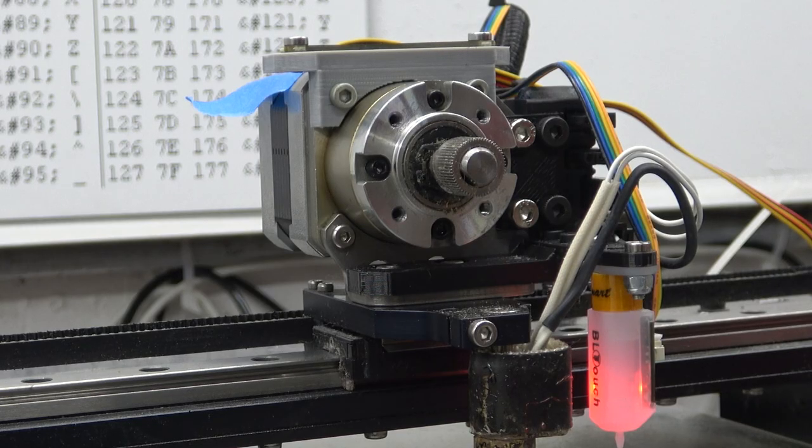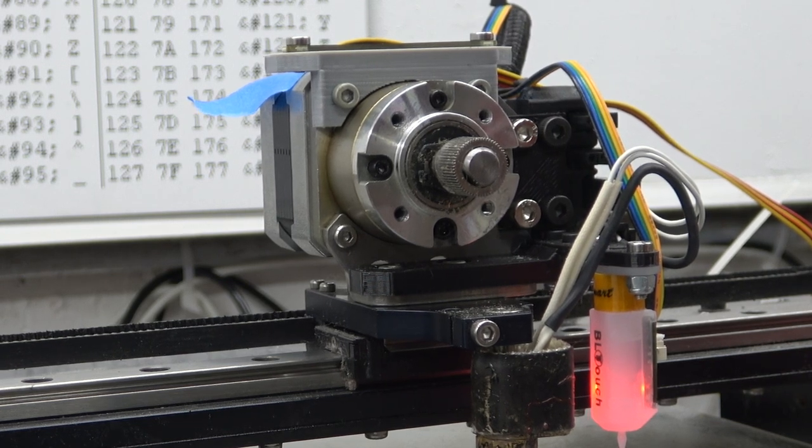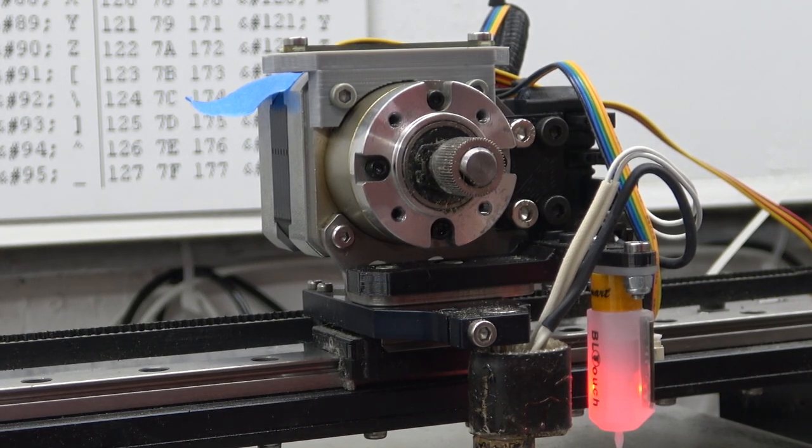Ugh. Okay, I'm gonna go SHAPER_CALIBRATE AXIS=X. Oh, there it goes, it's testing the frequencies. I've left a spool of filament attached to the printer because in reality the printer's gonna have to deal with that, and that spool of filament would cause the inertia to change. I thought this was gonna be a lot more violent. Oh, it's increasing the frequency.